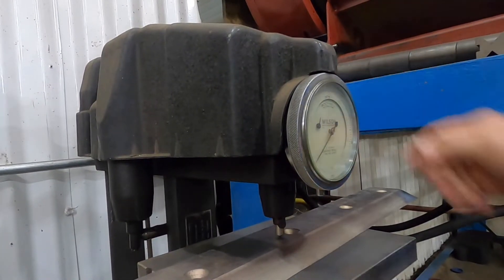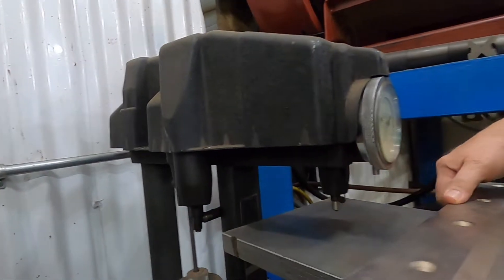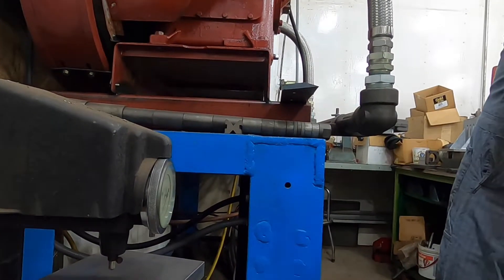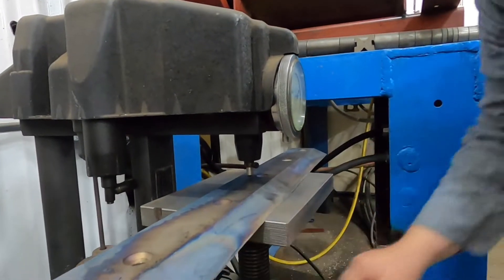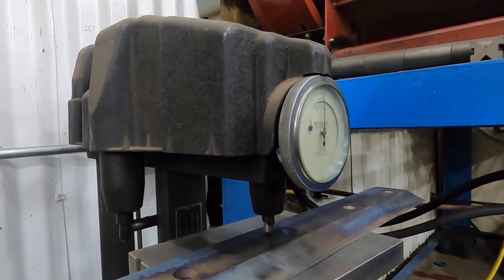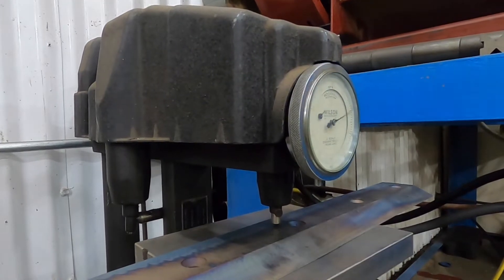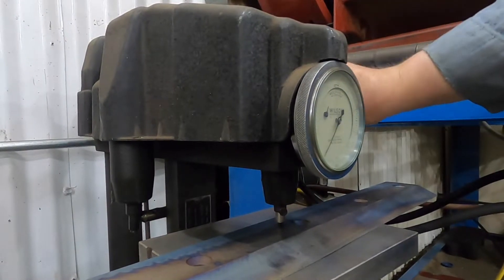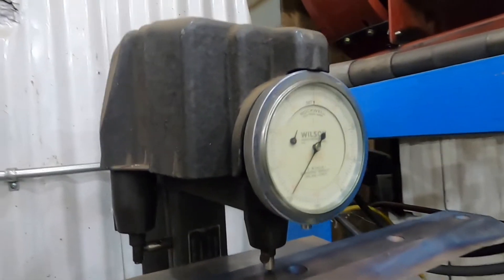Anything over 50 is not a bad knife. Over 60 is generally considered good. There are other tests for the metal as to whether it's brittle and comparable problems. Our first test pieces came out real nice at 60 and 62. The 60 was one I had hardened at 1750 degrees, and we're coming out at just pretty close to 61. The second piece I tested, I did at 1800 — and we did all of these at 1800.